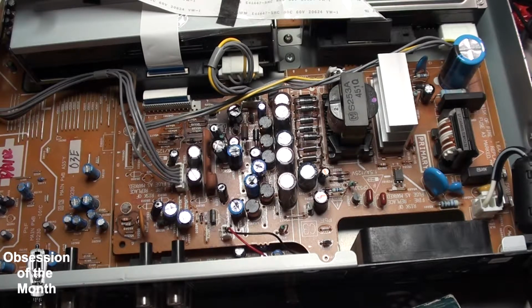So really, the issue with this board is that the power supply just barely has enough power for the hard drive, and I think as the hard drive ages, it maybe draws a little more power, and the board can't handle it. The hard drive claims it only draws 590 milliamps at 5 volts and 590 milliamps at 12 volts, but that's kind of a lie. At boot up, it takes almost an amp.